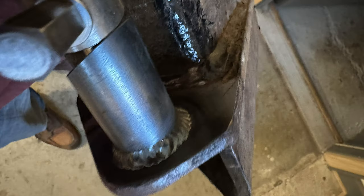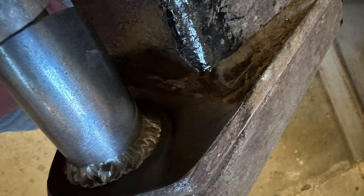I thought my camera was filming and apparently it wasn't, so I only have a couple pictures of the finished product. Real simple job — once that piece was knocked out I just fit the new one when it was dropped off, ran two passes over it with TIG. You could use stick, MIG, flux core, really anything for this job; I just used TIG because my welder was already on. I apologize for not having more footage. It welded like new steel, no real issues. I didn't weld the opposite side — if this is a replacement for what broke, welding the other side would just make it harder to repair and it really doesn't need the strength. All it needs to do is stay attached so the pin does the work. There you have it, thanks for sticking around guys.